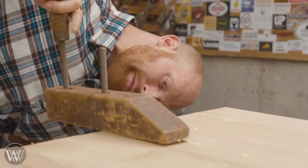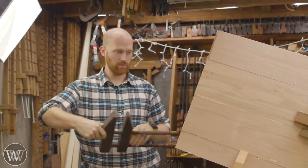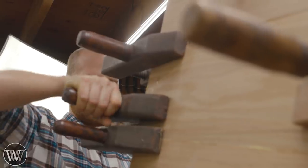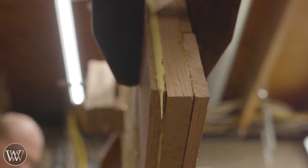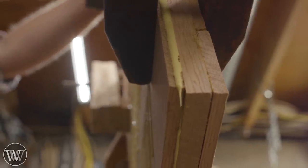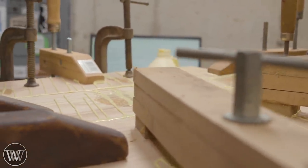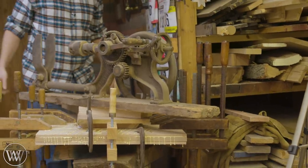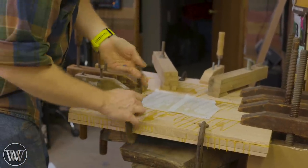I ended up using all of my hand screw clamps — I have about a dozen, some with wooden screws, some with metal screws — and went all around trying to put them on all of the seams so the pressure is where they want to bubble up. The thin layers were cupping because they were absorbing the glue, making the glue-side flex out, so I had to push that back down. Clamps all around the perimeter, with glue squeezing out, and I put about 200 to 250 pounds of weights in the center.